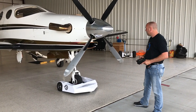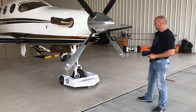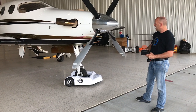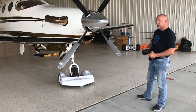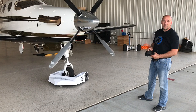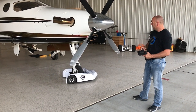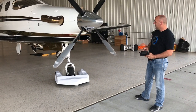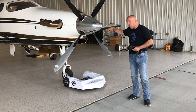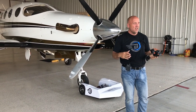I have the option on this tug to simply flip a switch and unlock a pivot — look at that — and now I can move the tug all the way around with the tire the way it is. If I want to lock that lazy susan I can drop a pin. I'm going to rotate the tug; when it's perfectly lined up it locked in automatically, and now I'm controlling the position of that wheel again. I can unlock it, rotate on a lazy susan — I can maneuver this airplane anywhere. I can drop the pin and now it's locked in the straight load/unload position, and I can flip my switch and drive out from underneath the aircraft just like that.